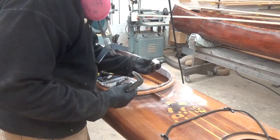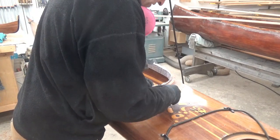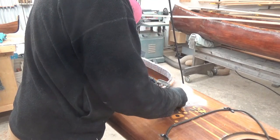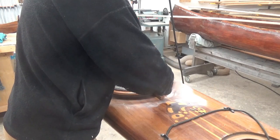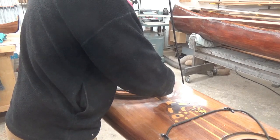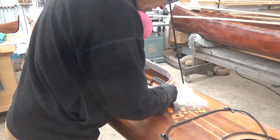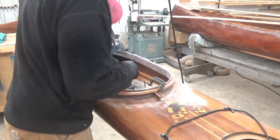I have C-clamps and little pads here to protect the inside edge. I want to make sure I'm pushing this down to my three-quarter block. Generally I want my C-clamps facing inwards because I need to get underneath there and clean the squeeze-out. If you don't clean it out now, when it's hard you'll never get under there.